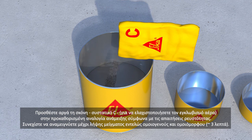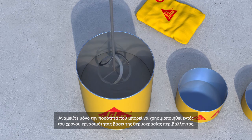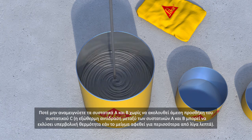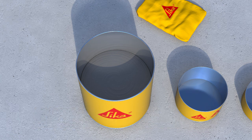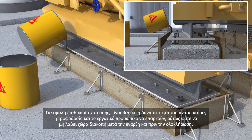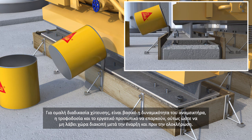Continue to mix until fully homogenous and uniform, approximately 3 minutes. Mix only that quantity which can be used within its pot life according to the ambient temperature. Never mix component A and B without then immediately adding component C, as the exothermic reaction between A and B alone can generate excess heat if allowed to stand for more than a few minutes. For pouring the grout it is essential that the mixing capacity, grout supply and labour availability are all sufficient to enable the grouting operation to be carried out continuously without interruption once started.